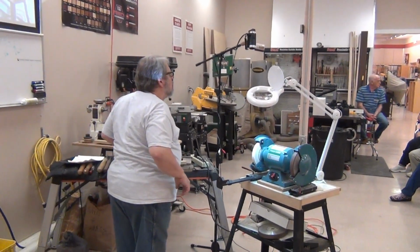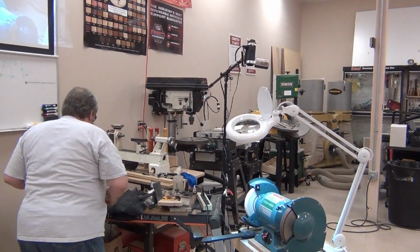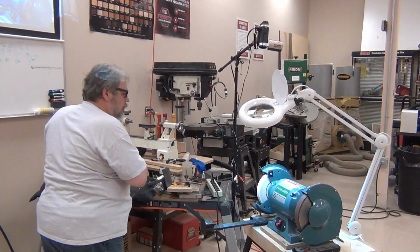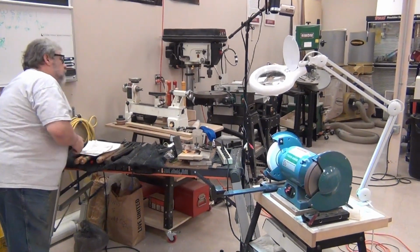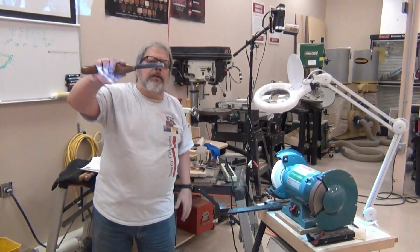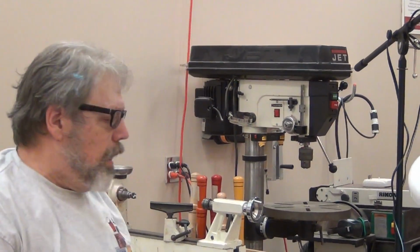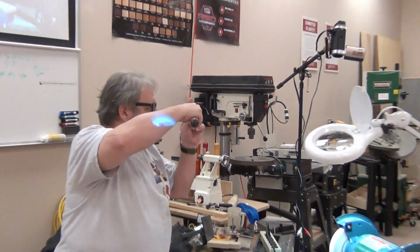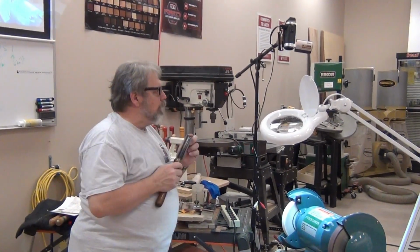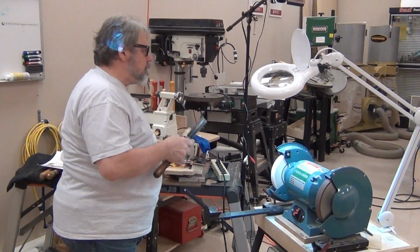Yeah. Are there any special degrees for the roughing gouge? You know, people do lots of different things. I don't really measure it. The standard is supposed to be 20 degrees. I'm probably a little more than 20, all right? But you don't want it that blunt, and you don't want it that shallow. If you're too shallow, you're going to vibrate this cutting edge. If it's blunt, it doesn't give you really much room to vacate the chips underneath the bevel.